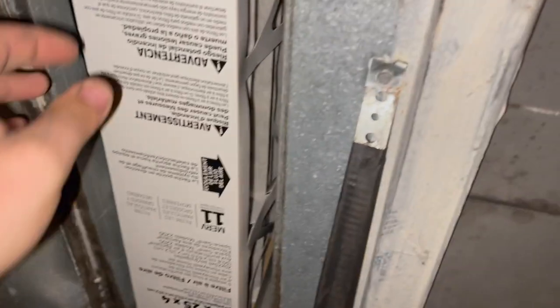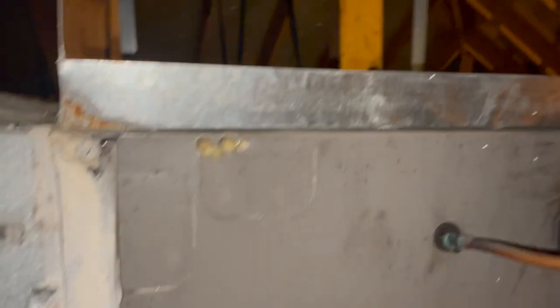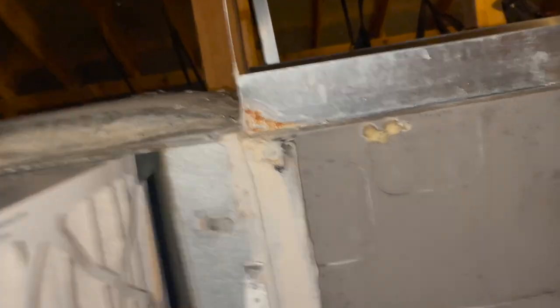The snowflake is flashing, so I think that means time delay. I know exactly who did this job — the old hanging air handler. They just put a piece of sheet metal, screw it to the unit, hang it, and then there's a media filter built into the return air plenum, and there's a little dryer vent fresh air duct. The unit still has not come on, so I don't know if the thermostat's acting up or if we have a delay. Filter looks clean.